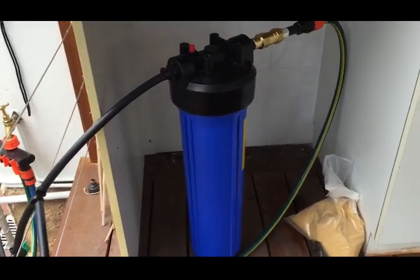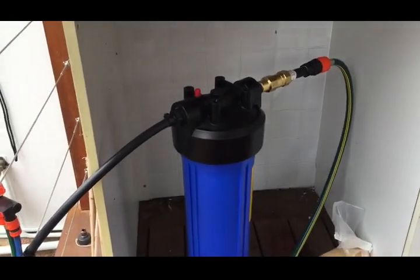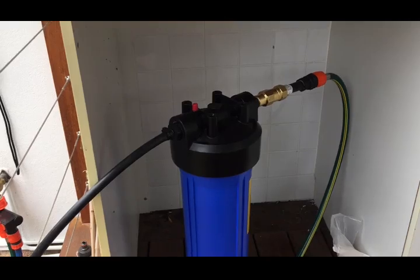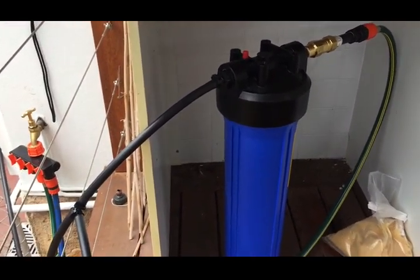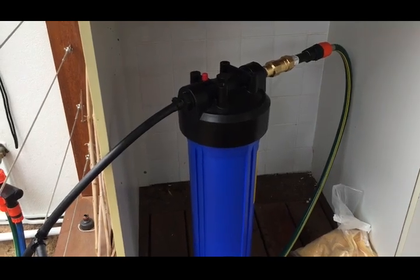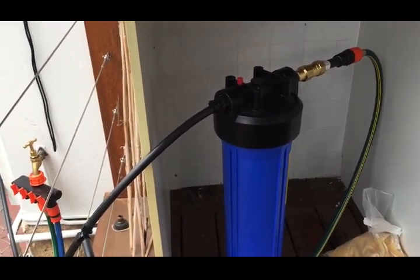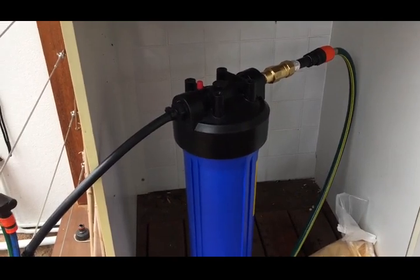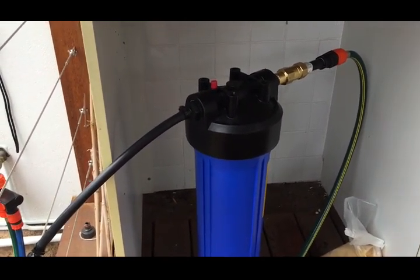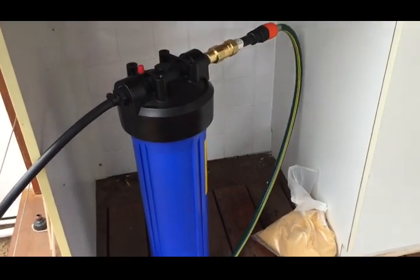The filter will fill up quickly because our water is quite hard. To regenerate the resin so you don't have to throw it away, you just backwash it. I've got a backwash line set up. You can backwash with salt water — a tank of salt and water that swaps out the loaded calcium and magnesium. Alternatively, I'll probably backwash with dilute hydrochloric acid. The protons swap for the calcium and magnesium, and when the water goes on the roof the protons and carbonate neutralise each other, releasing CO2 and leaving essentially pure water.